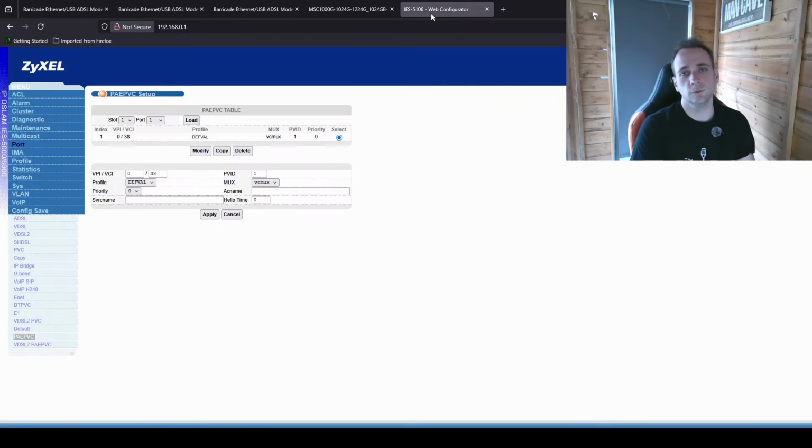Now, the issue was, as I said in the previous video when I was actually configuring it, going to be that VLAN. Now, I had hoped in my heart that on the MSAN it was doing some form of internal tagging and passing it off as an untagged port, but that doesn't appear to have been the case. It does look like it was passing the tag on the whole way through, and of course, because we're not doing anything with that VLAN tag, nothing was working. So I've actually put it back to VLAN 1 on the PPPoA side and configured it for 038.